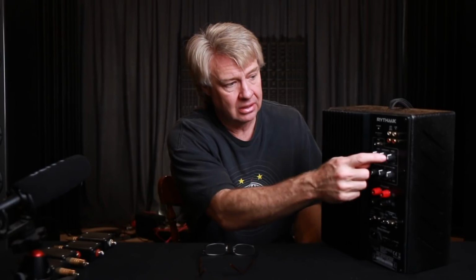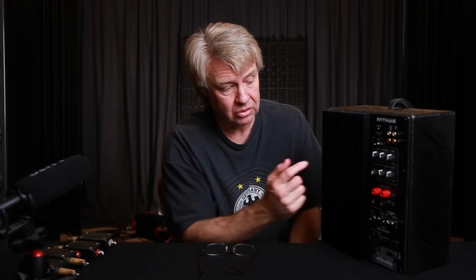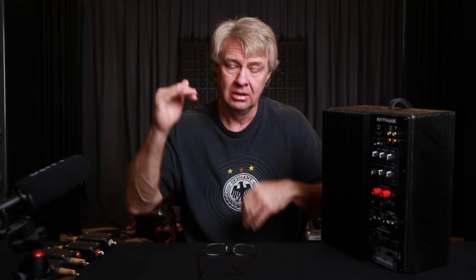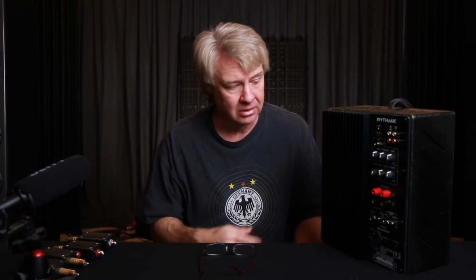You can have this adjusted a little above it and then cut it, or you can have this adjusted a little below it and then cut it at that certain frequency. So you can really make it do a lot just with those two positions at reducing output more in the higher frequency range if you need it to be steeper to match the roll-off of some speakers. Some of our open baffle speakers, sometimes they're pretty flat down to 50 hertz and then they drop off pretty quick. It's just the way it loads the room. So you can match the slopes with that real easily.